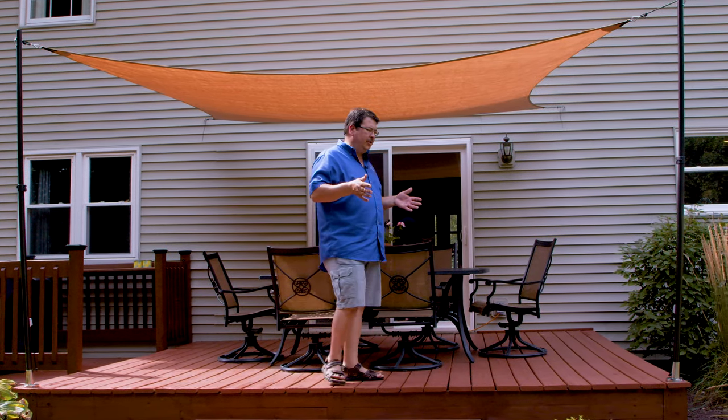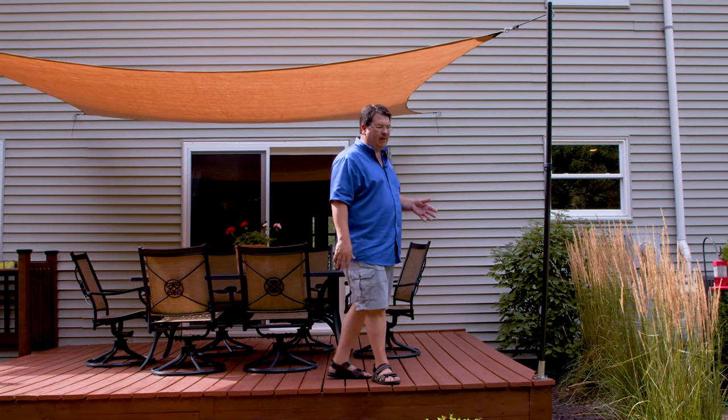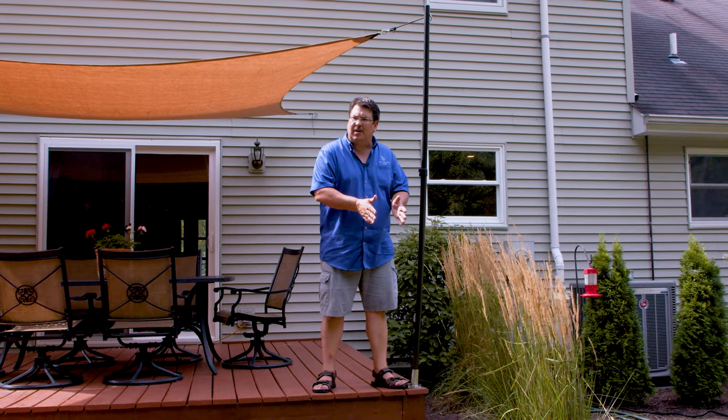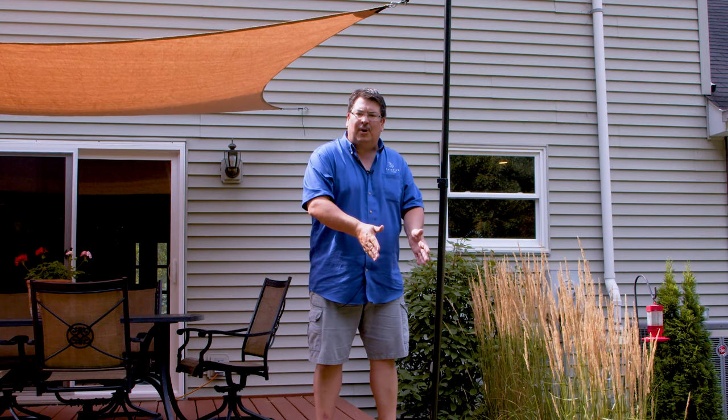You may be asking, why not just install a permanent sail shade or sunshade? You can do that, but there's a little bit more labor involved. To install a permanent sunshade, you would have to use a 4x4, 6x6, or steel post and dig a hole with a footer, usually concrete. The labor is more intensive. But by installing a permanent post, you can use turnbuckles on the sail shade and draw it up tightly, so you could use it all year round. If you have a lot of snow, you'd want to take it down in winter; otherwise, if you wanted to leave it up all summer, you'd need posts at the corners and turnbuckles.